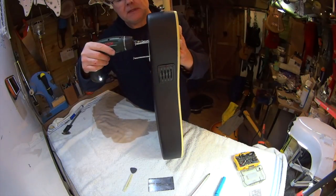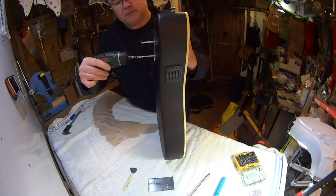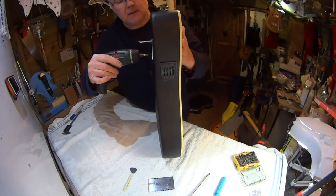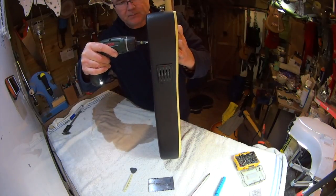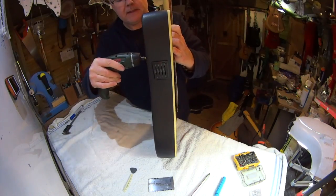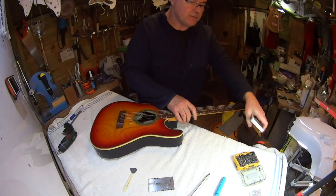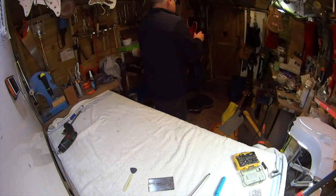So that pulls in nicely. A little bit more harder work. On a torque of 5, which is a pretty good neck setting, I can feel that pulling in nicely. And there, and there. Okay. Now, let's just take that off. I'm going to put this out of the way for a second. Guitars everywhere. All safe? Good.